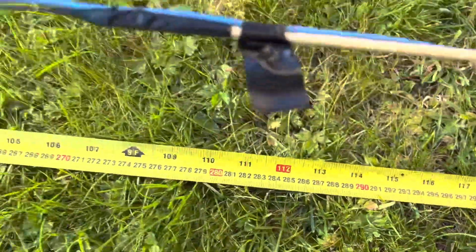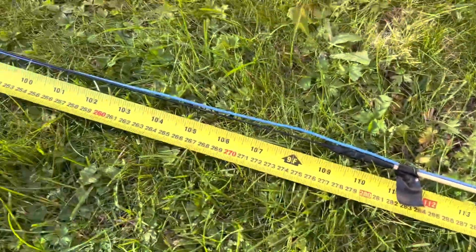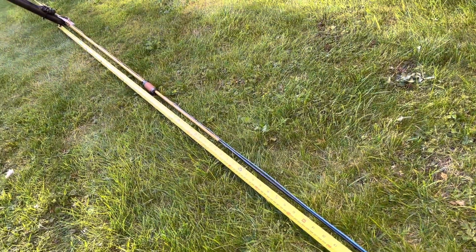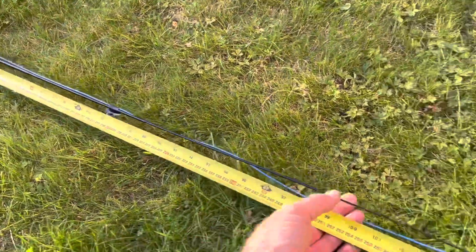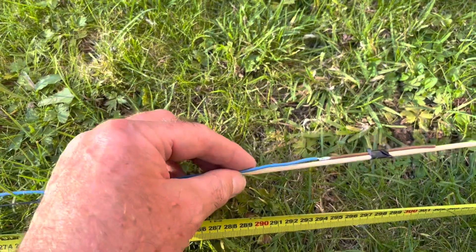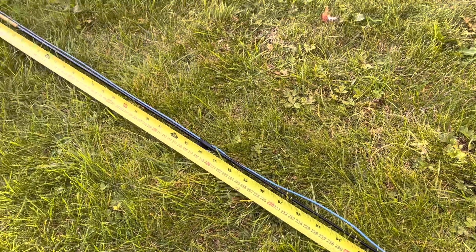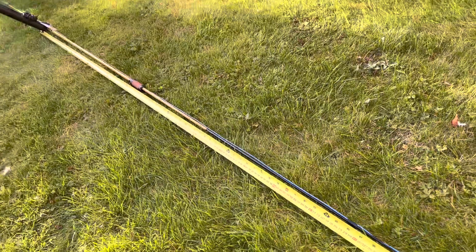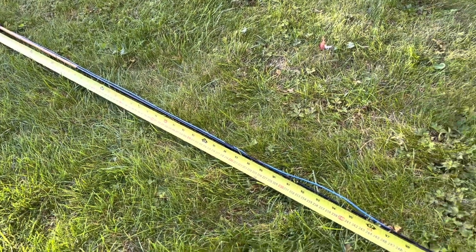Even that's quite heavy for this little end and it's quite thin. When I applied these poles — I bought them as fiberglass poles, advertised as fiberglass — I'm beginning to think the black section might be carbon, because the resonance was the same as with the bamboo canes but the SWR was a little bit higher. Despite checking, this was advertised as a glass fiber pole.